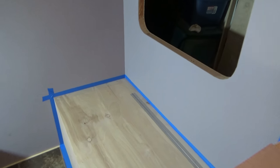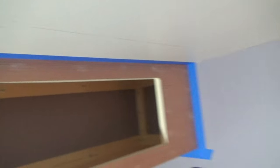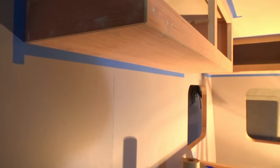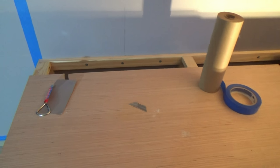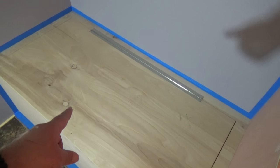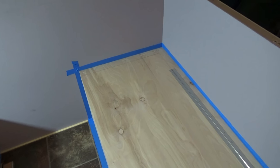I hope that helps. Well, it took a while, but everything I need - at least masking around the edges of all the places I'm going to paint - is done. We've got it on top and bottom, ceiling, walls, front, back, in and out. Next step is we're going to take our roll of paper, rip it into about 18 to 20 inch pieces, put tape on one edge, and then put it along our seam all the way around. Once that's on, we will begin painting. The last things I'll paint are the tops of the benches, because I'll have to remove all the hinges, paint those, and then reinstall them.